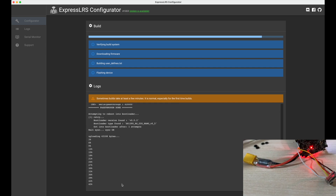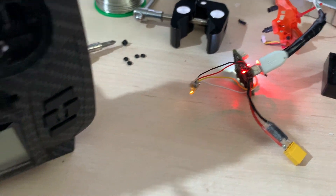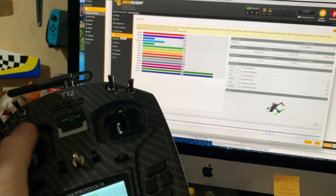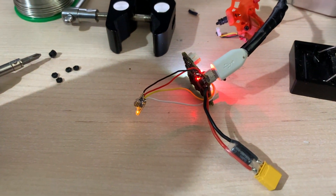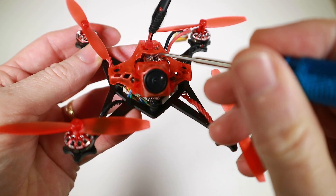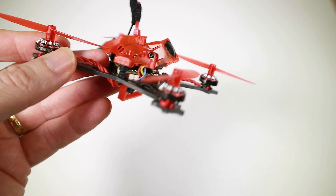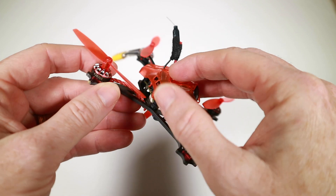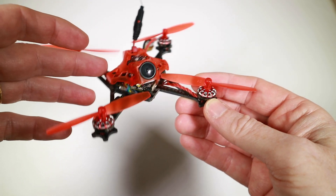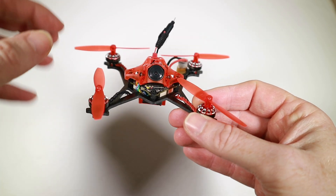It's doing the upload — we're getting a rapid flash from the receiver and it says it worked. The Namimno module is in the radio, we've got a solid light, and if I move the sticks you can see movement — so that's good. I'll fit that back inside and then we can look at how this thing flies and what the range is like. Here is the receiver fitted in there — you can just see the little ceramic antenna poking out just on top. I've also updated Betaflight from the old 4.0 beta to the latest 4.2.9 to take advantage of the built-in CRSF telemetry. A quick hover in the garden suggests it doesn't need any tuning.